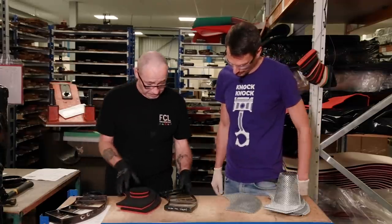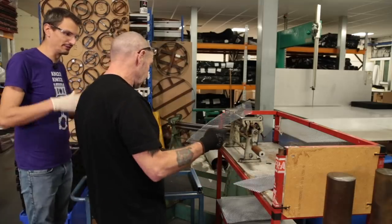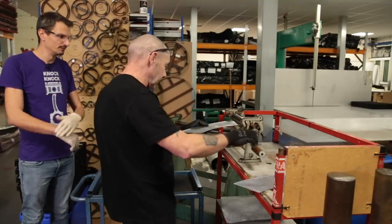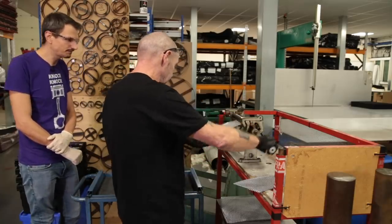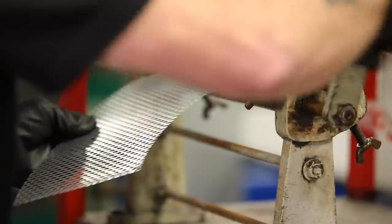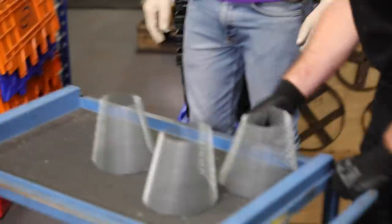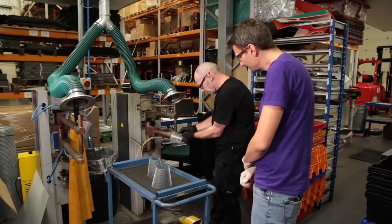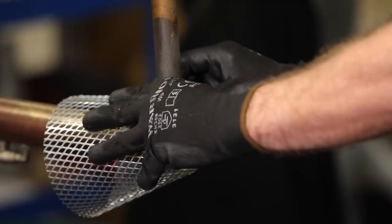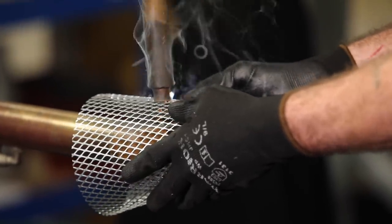And there we have it — all of the bits we need. Now onto rollering and welding. This is what's going to give us the shape we need for the cone. You slightly put it in, give it a little bend up. You turn it as you're rollering it, and that's that. So you've got your basic shape, and then you take it to the spot welder, put a spot at that end and a spot at that end. After which the spot weld process is continued down the spine of the cone.